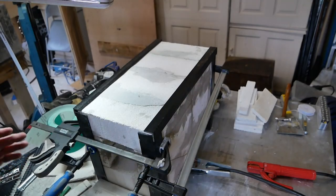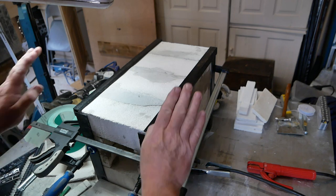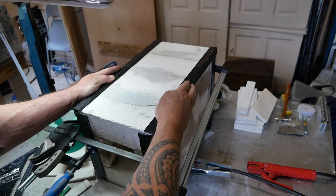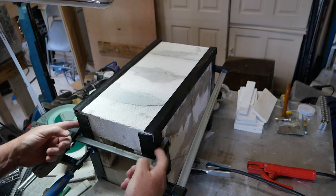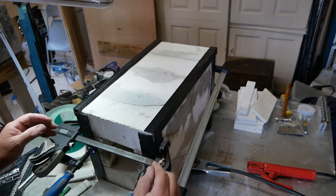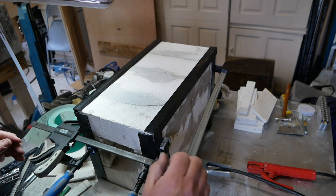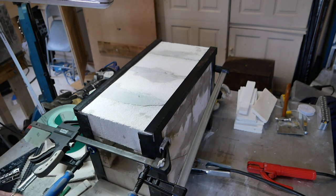In order to rectify the warp in the base, which I described earlier, I've decided to do two things. One, to rectify the warp that way, I'm putting these braces, these small angle irons across the top, which I'm going to weld to the uprights. There is the gap here. I really don't care about that, as long as they don't impede on the door. And that, in addition to a piece that I'm going to put along the bottom, will hold the braces for the control box. So that's the plan at the moment.